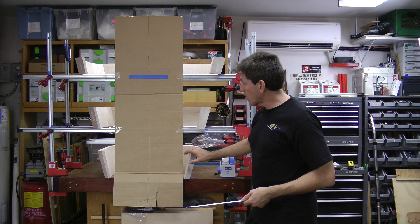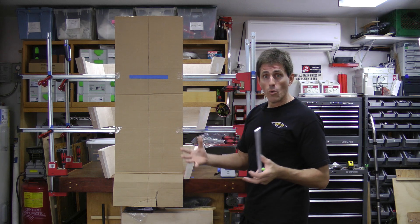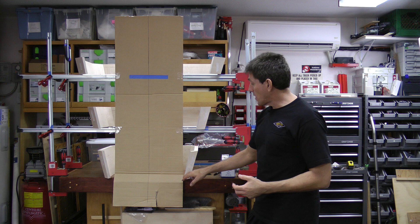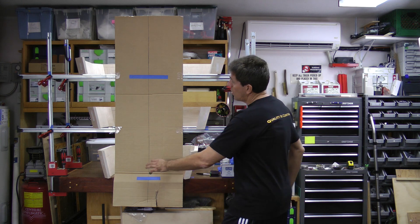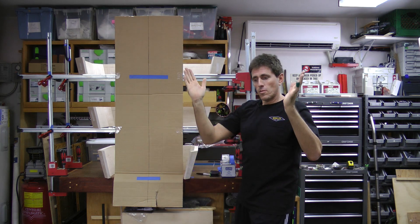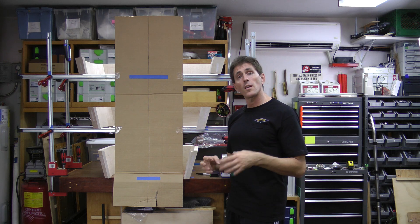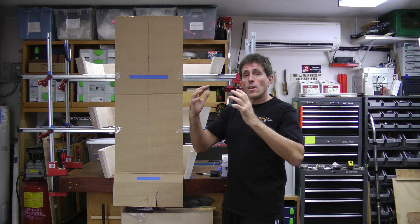To explain how this works: the bottom piece is not sitting on the ground — there's actually three inches of clearance between it and a box that's going to support the whole thing. That box will be square, not tapered, adding that pedestal foot we really want. Continuing the one-third idea, down below we'd have a little over 18 inches, so about a six-inch width at the bottom, tapering up to 10 inches. The top will clip off flat and square, then I'll add a bevel all the way around. That taper on the top will be relatively easy since I'm cutting it as a veneer — veneered onto the column — and then at the top we can bend it down and create the facets.